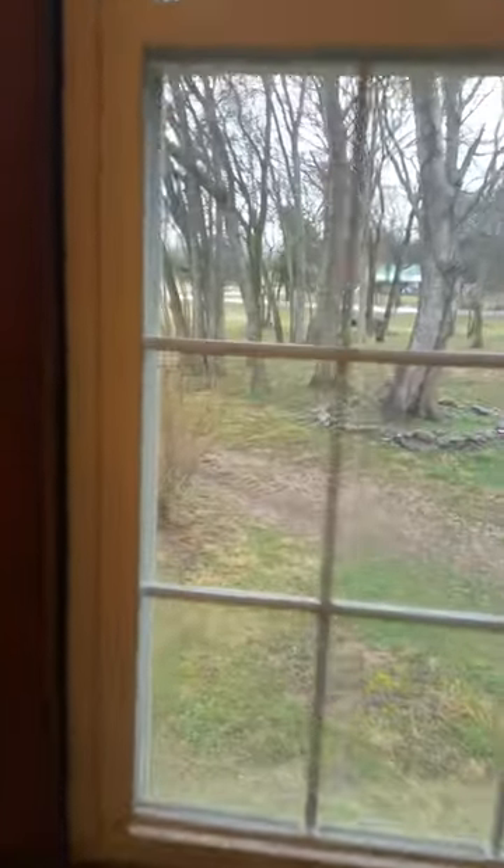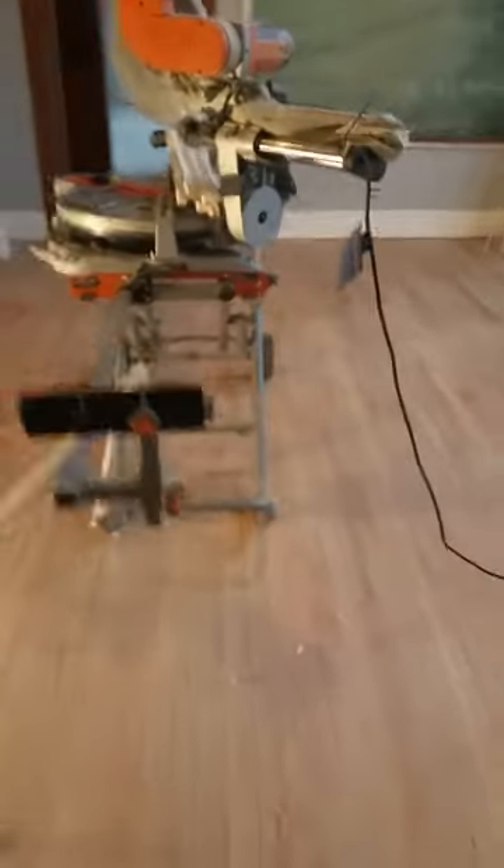I'm here in our front room and all the windows were never finished out. This crack right here is insulated but doesn't have finish trim, so I'm putting what's called shoe mold. Shoe mold is like a quarter round but it's kind of flat on one side and longer on the edge.